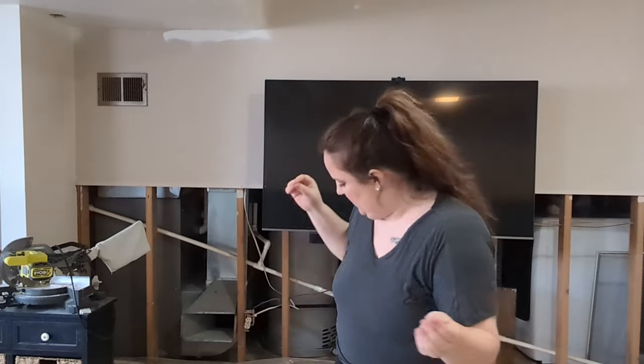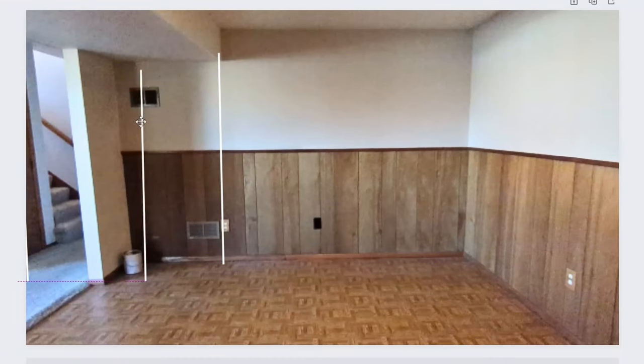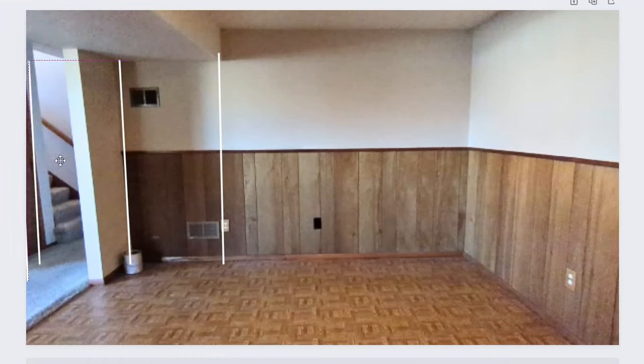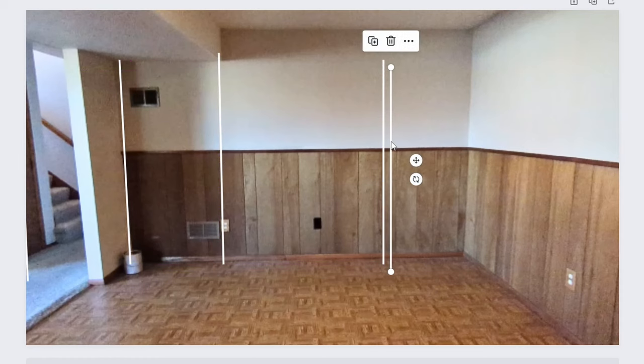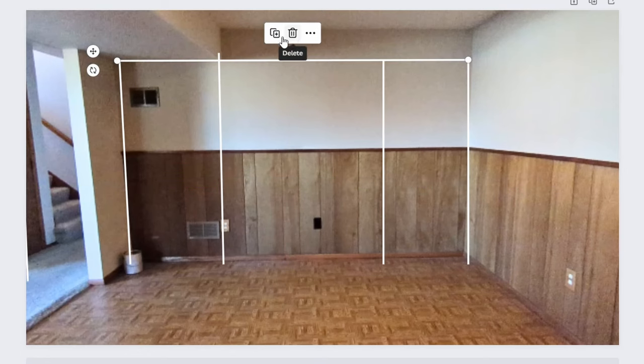What I've done is I have taken the measurements and planned accordingly. Our biggest obstacle is this drop down of the ceiling. You can see here, that is the ductwork for our AC that runs throughout the house, so we can't really do anything about that. How I'm going to compromise with it though is I'm going to do a bookshelf coming down perpendicular to that wall, to this drop down, mirror it on this side, therefore giving me bookshelves right here.